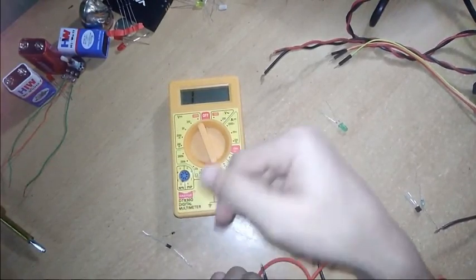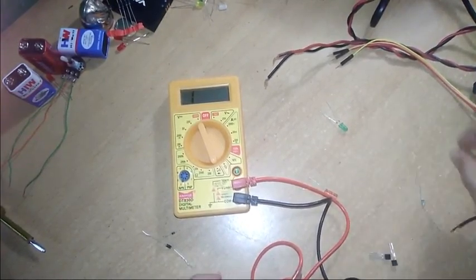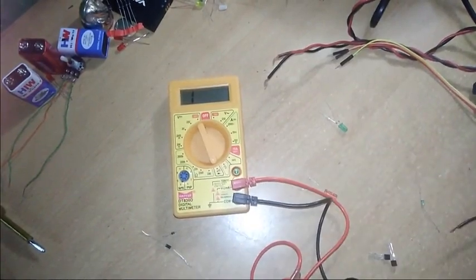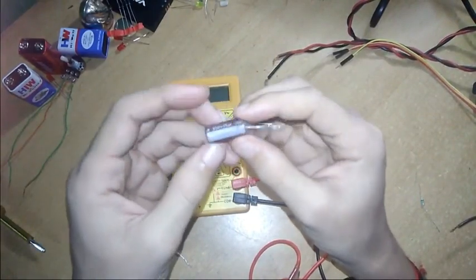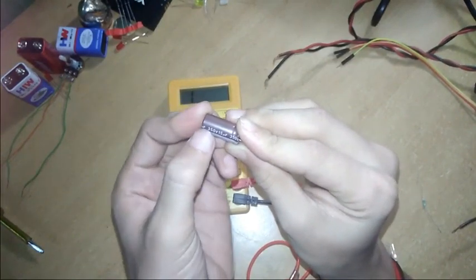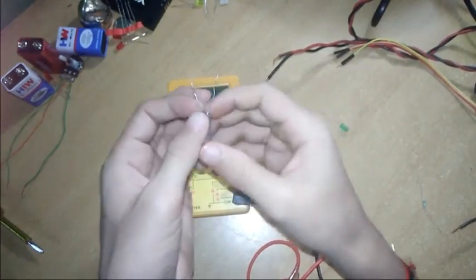You can comment below. Now I will show you how to measure the capacitor, how to check whether it is working or not. Its value is given on this. It is 350 volts, 15 microfarads. Now I will show you whether it is working or not.